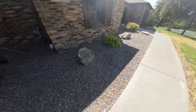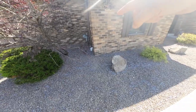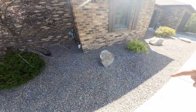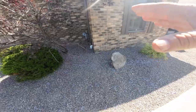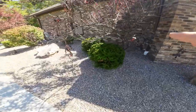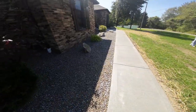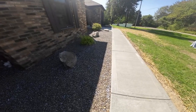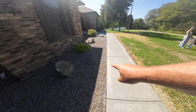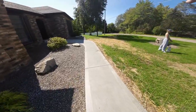Now in here, we had some big drainage issues when we first started. A couple of the issues were that the downspouts were just running up on top. However, it was directly clay below the mulch, and it was actually tipped back towards the house. Over time they had put more mulch in it, and it actually came above the brick wall, so it was running down into the house. So we took out about 5 or 6 inches of that clay, and we made a V underneath the sidewalk so that the water runs down just to the left of the edge of the sidewalk here. And that catches a drain for all the downspouts and then sends it out to that sluice pipe down there on the end.